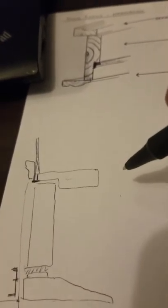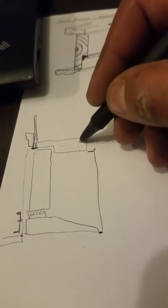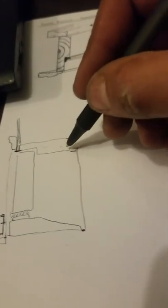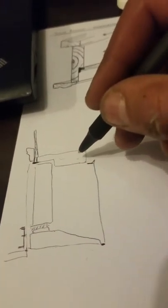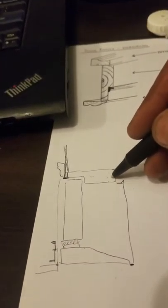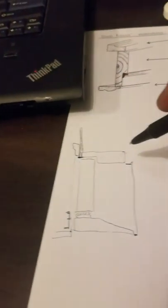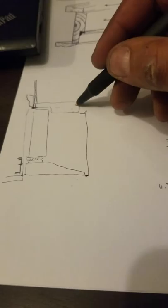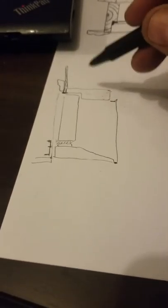If you want to go with the measurement of the door that's in there now, you'd measure from the exterior — from underneath the sill, all the way up to the bottom side of the jamb. The bottom side of the jamb is generally about an inch and a quarter thick, though in an older home — pre-1980 — you might find a true two-inch piece. I'd use an inch and a quarter as your safest assumption: if it turns out to be an inch and a half, you have a quarter inch of free space to work with.